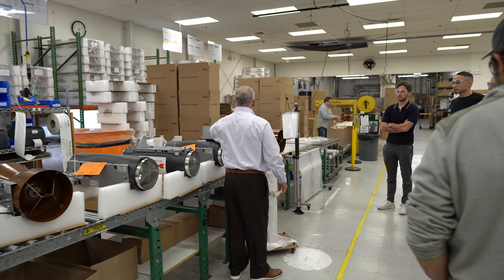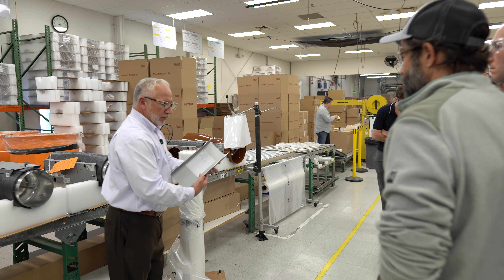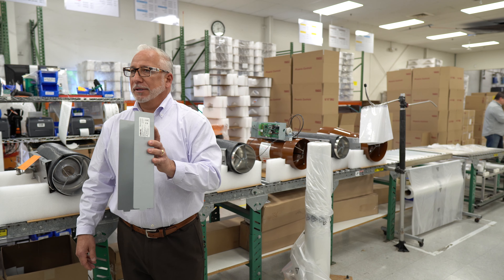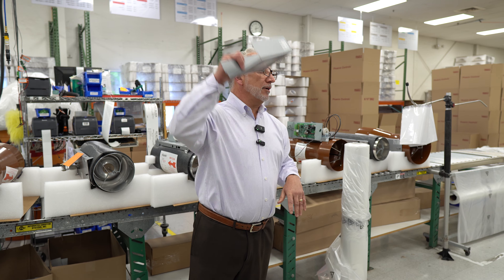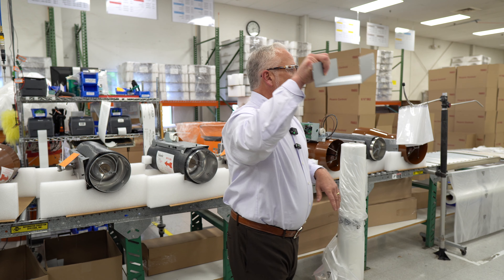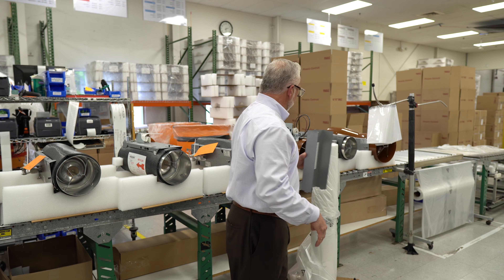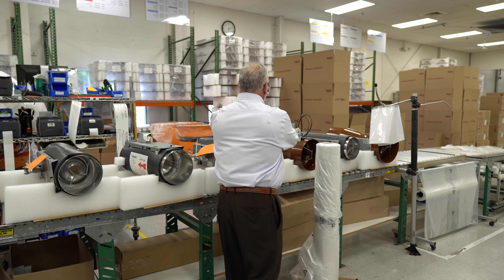At this point in the process, it's wrapped up. All the wires have been terminated. What we've done is actually put the calibration label on the device — it has the serial number. Typically what's going to happen is once they take this cover off, it sits up on top of the drop ceiling and you'll never see it again. It's good to know that it has the serial number. Everything is plugged in, wired up, and the terminal blocks are all done.